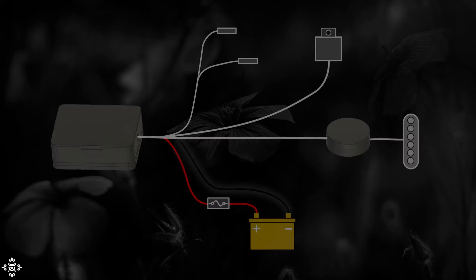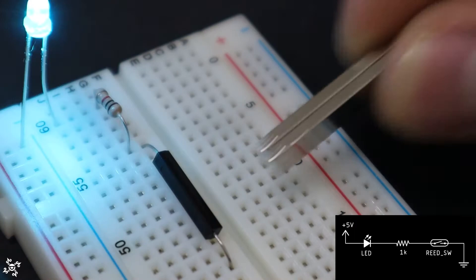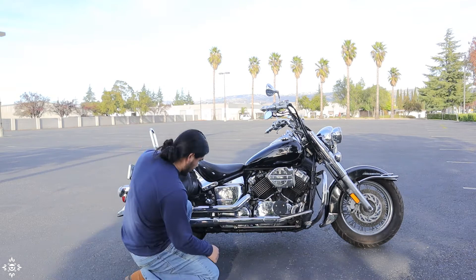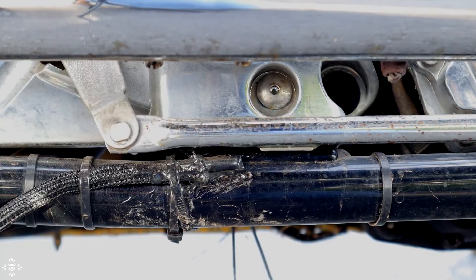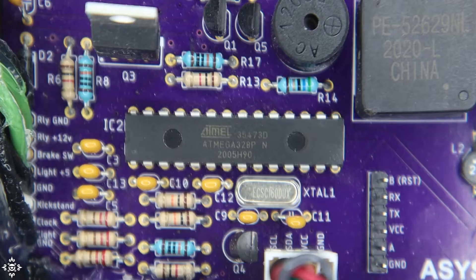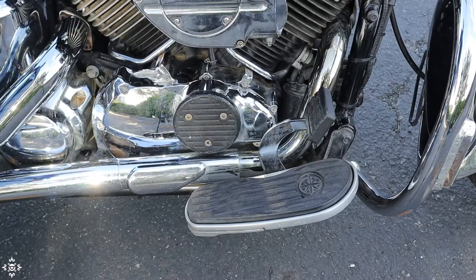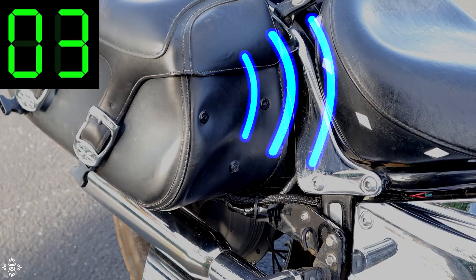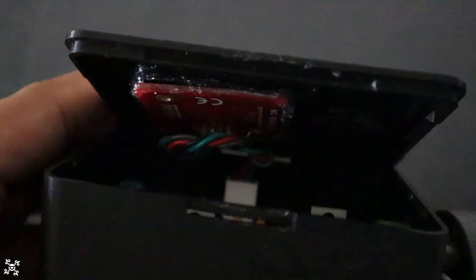Fortunately, after considering different approaches, I came up with a nice solution that basically makes the system consume no current at all when the motorcycle is off. Looking at the diagram, we see two rectangles representing reed switches — simple components triggered whenever a magnet is brought near them. The solution works like this: I mount a magnet on the rod connected to the brake pedal mechanism and a reed switch on the frame close to it, so when the pedal is pressed, the magnet causes the reed switch to close, momentarily powering on the main board. Afterwards, the MCU takes over and keeps the system on once we depress the brake pedal. The reader will start looking for tags, and if the system doesn't detect one for a predetermined number of seconds, it will turn off automatically.